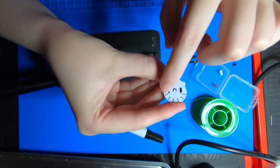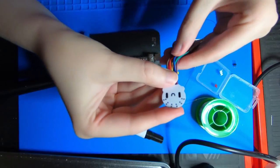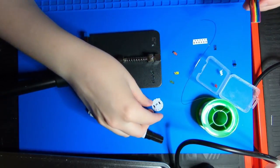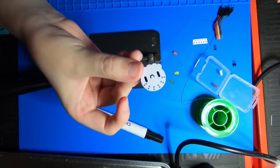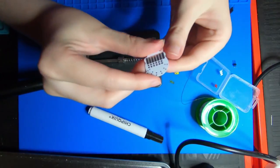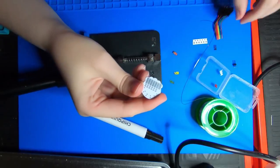What happens is there's going to be LEDs around here and it's just like a simple LED circuit. So if you need to test a microcontroller or blink or anything like that, you can do it with multiple multicolor LEDs. It's using 0603 components, which should be exciting. The LEDs go here and then on the back we've got the resistors and the jumper wires will go here.